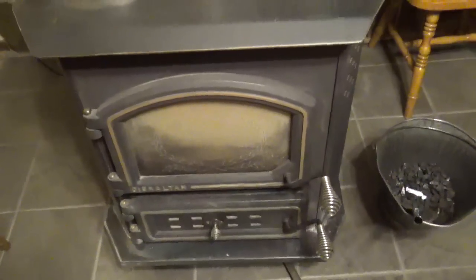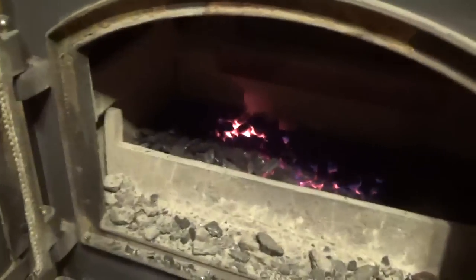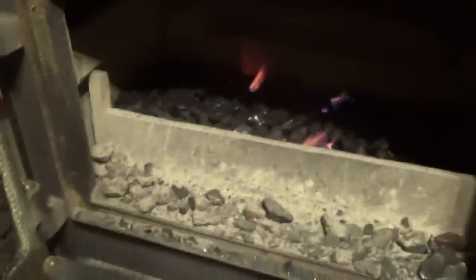This is like a double wall stove, so it's a lot wider than the one I showed you this morning and also a little deeper. Just a simple stove pipe again, with that flap damper. I only leave it at a 45 at night, because you want to make sure that any carbon monoxide buildup with coal can go out. There's coal in there, but that fire needs more coal — and that's about all the coal you need for the night.